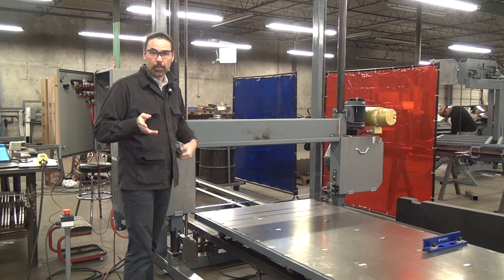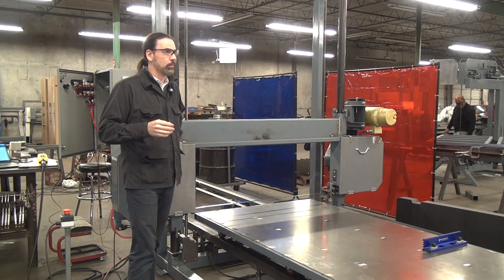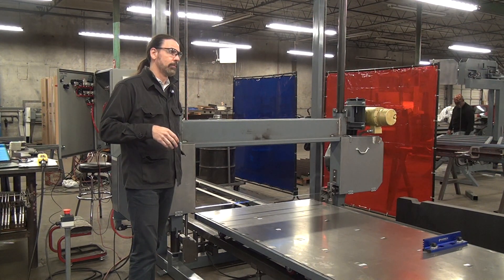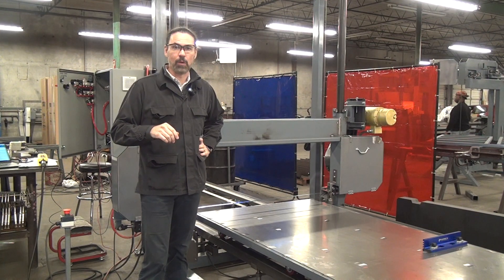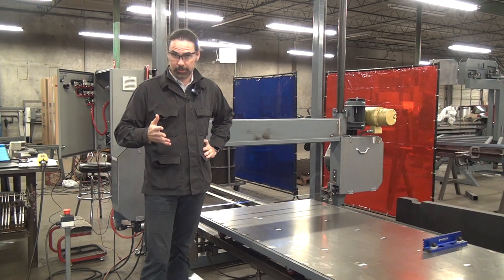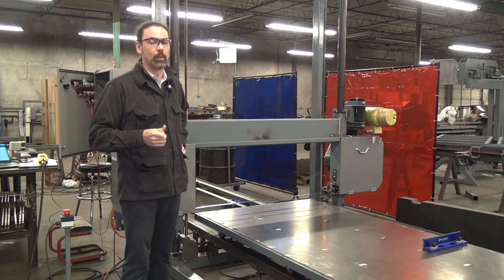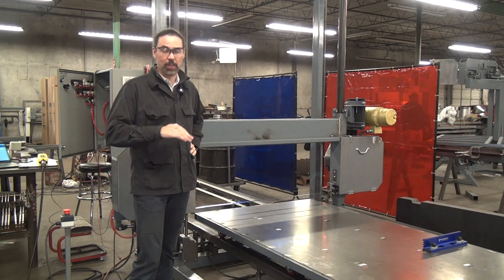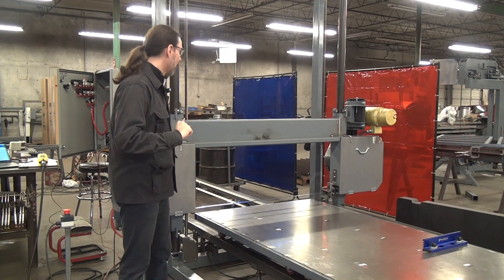This particular machine has been upgraded to a five horsepower blade drive motor. The blade speed is fixed on this machine at about 3,100 feet per minute. We do offer as an option a variable blade speed drive, but most of my customers are cutting things with pretty reliable cut characteristics and that 3,000–3,100 foot per minute blade speed is very reliable.